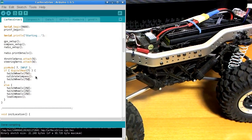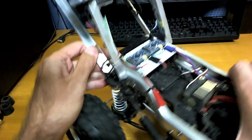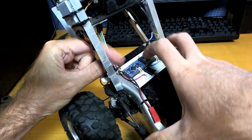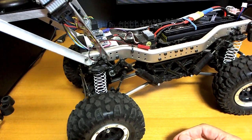The problem here was — if you're very astute you may have noticed it already — this digital read on pin 7: I didn't have any pull-down resistor on there. So pin 7 was just floating, meaning it was a little bit random if I wasn't pulling it high intentionally. To pull it high, I would just hold a little piece of wire on VCC and pin 7 when I turned the power switch on. All I needed to do was either hold it low at startup or add a pull-down resistor. The result was that for the first half an hour or so of my video, the compass wasn't calibrated at all — but it still did okay.